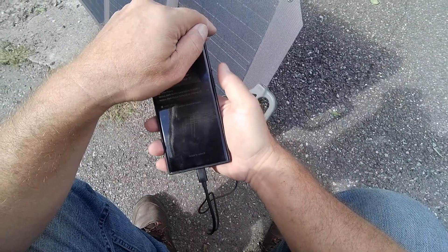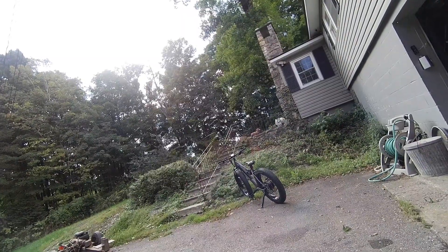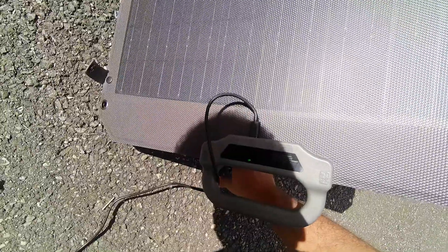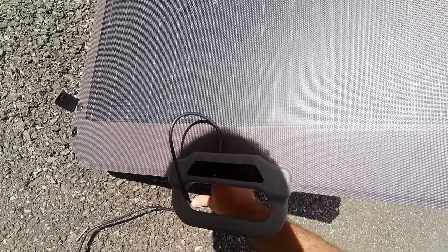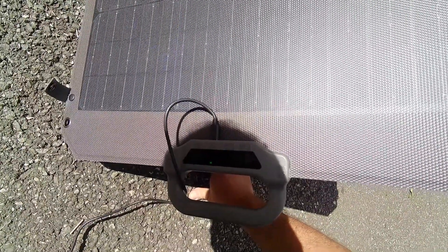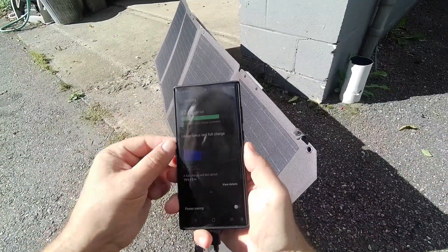It's back and forth because the sun's not out yet. Come on clouds - got Hurricane Ian coming up this way later this week, probably. There's the sun - fast charging, got a little green light right there. In standby mode the indicator light is on for three seconds and off for six; under working condition the lamp's always on. There's what looks like a yellow light - the overcurrent protection indicator is on for three seconds and off for six. It says 72% available, fast charger connected.